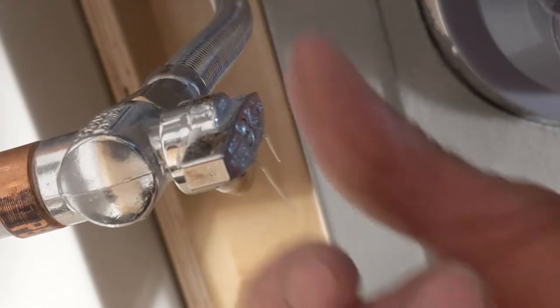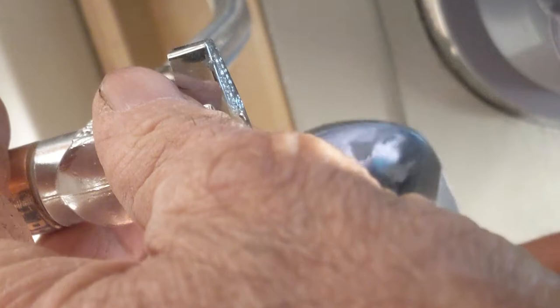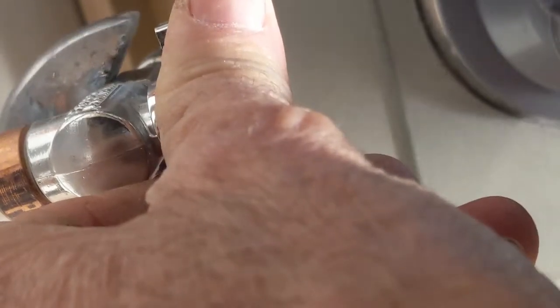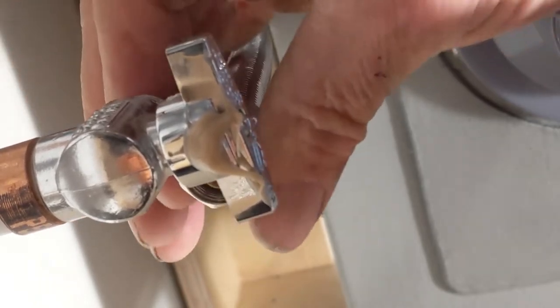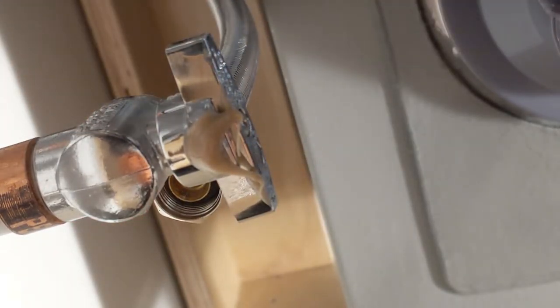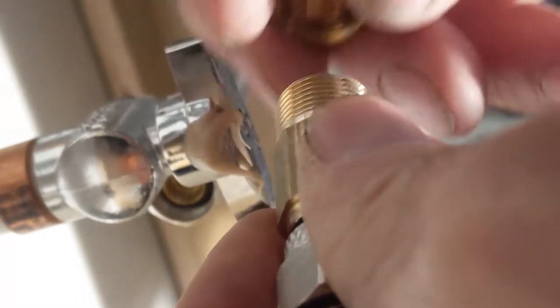So my friend, the hole is done. To start with, I'm just gonna turn off the cold water — there we go. Open the faucet, unscrew this guy up, just hold tight to the other pipe, that way it doesn't cause any problem with the connection. There's probably gonna be some water dripping in there. No drip — I just opened the faucet to drain, then I close it again. So in this case I'm just gonna remove this piece that we don't need, and remove the old one.